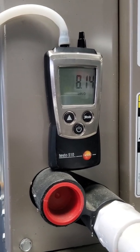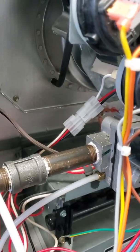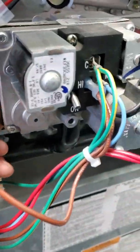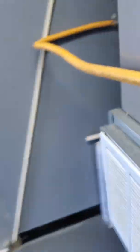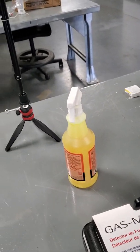You can hook up on this side and watch your pressure as the unit fires — it shouldn't go down too much. After checking our inlet pressure, shut off the gas stop, pull the adapter, reinstall the plug, turn the gas stop back on, take your leak detector and check for leaks. You can also hit it with a little bit of bubbles to check for leaks. Always make sure that fitting isn't leaking before you leave.